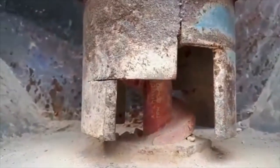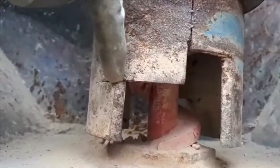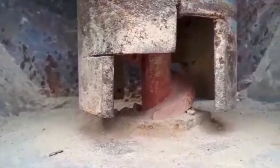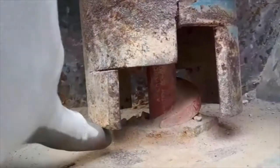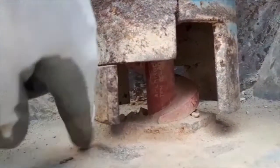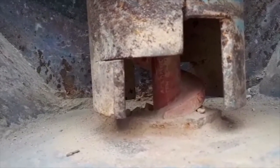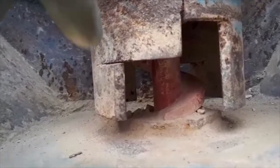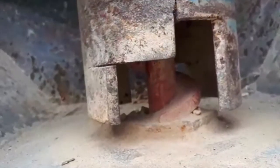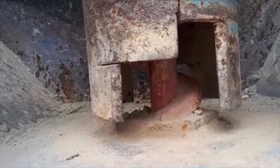What you have is the tube rotating around the static screw. Helped with these scoops, the material will go in and be elevated and conveyed. There is an important gap, as you can see here — almost one inch, some 20 millimeters, depending on the product — so no particle will jam in there. It's very simple: no seals, no bearings, no contact with any moving parts or any grease, because the bearings are outside.